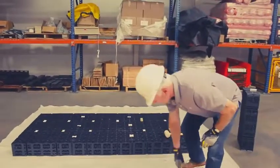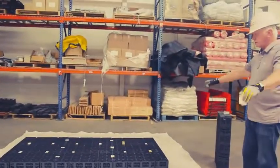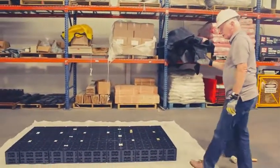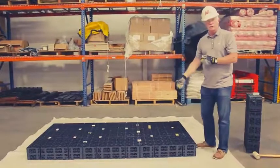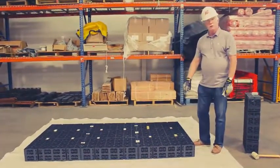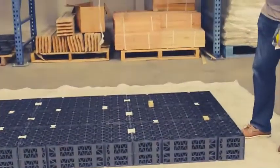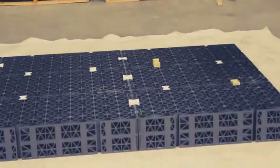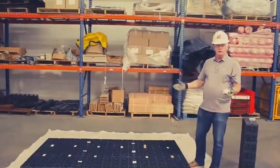When you're done with everything and your units are in, also the piping required for the overflows and the outfall — you can drill through permavoid. Just go in between the cylinders and you can insert the pipe down into there, into the outlet connectors, into the top of the unit, based on the dimensions.